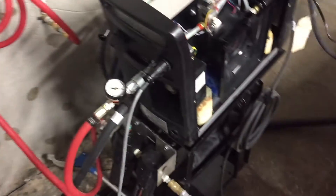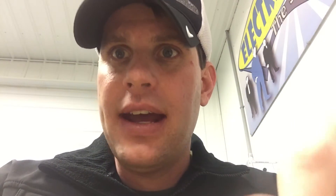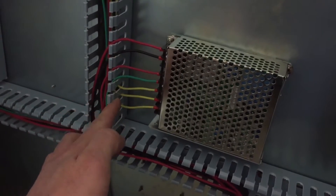You're carrying up to 300 volts down a very small wire — I don't even think it's 20 gauge. It's not circuit-protected whatsoever, so you're running into problems: issues of melting your wire, and of course safety issues. 300 volts is enough to hurt somebody. So instead, we're going to make it carry 50 to 1 from the Hypertherm Powermax the way it's designed, and it's going to decipher correctly in the Start THC controller card.